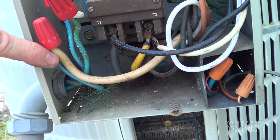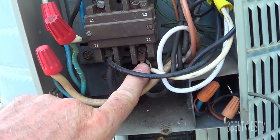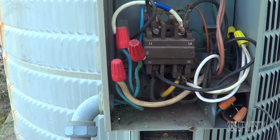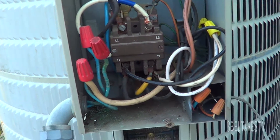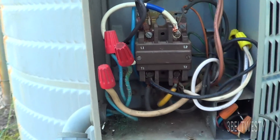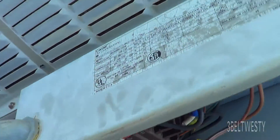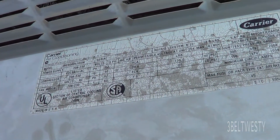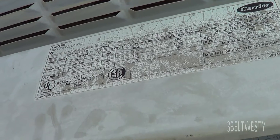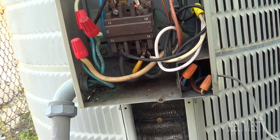On this type of setup it's kind of screwball, because this is actually 208 volts to ground. So when the contactor isn't pushed, these two legs are 208 to ground — which is really something to be aware of because if you go poking around there you can get knocked on your butt. You shouldn't be touching that. They are only switching two out of the three phases. This is an old Carrier round 5-ton unit, model 38EN060510, 208 to 230 volts, R-22. It's about 30 years old and still runs real well.